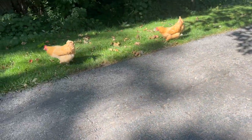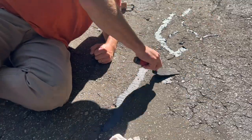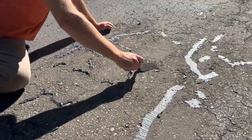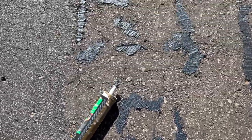Some of the smaller ones I'll try the pourable, and then I've got some bigger ones up here where maybe I'll do the caulking. This side is just as bad. You can see that tube of caulk is done already — there's actually a grit in it. It'll work well for defined cracks, but these that are more spider cracks are a little difficult. You definitely need to trowel it and push it down into the crack.